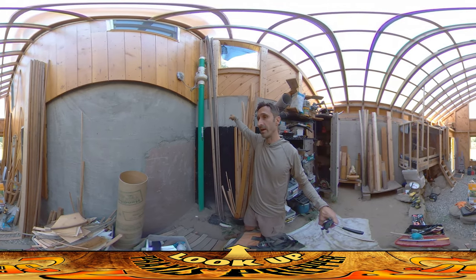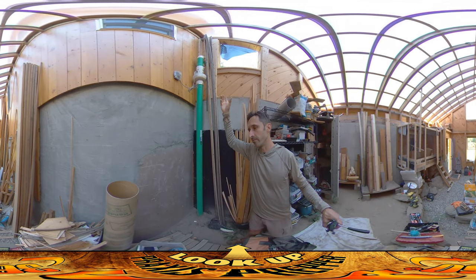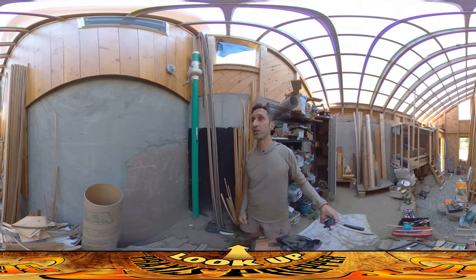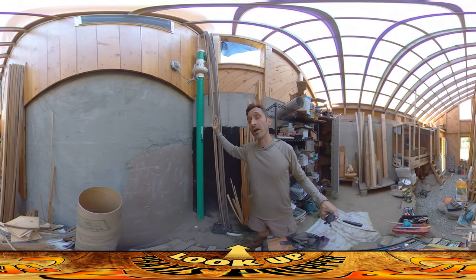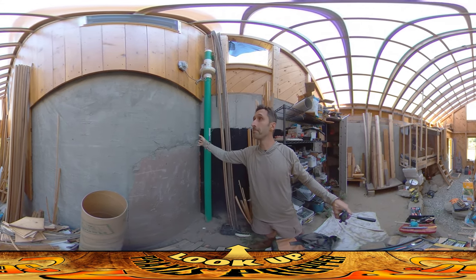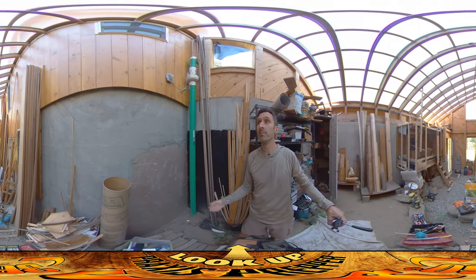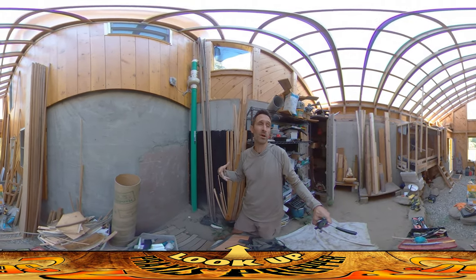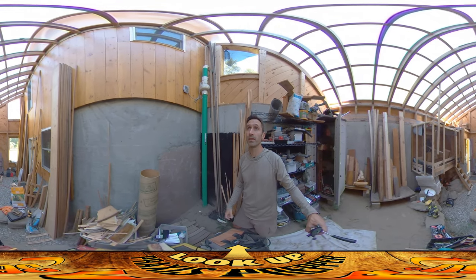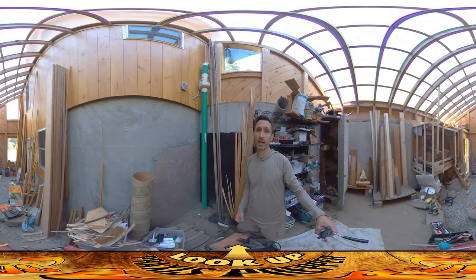If you recall, there's that air intake up over by the root cellar. One tube goes down into the root cellar, and the other tube is going to go into our air exchanger. So air comes in from the filter underground, passes into the pantry, into the air exchanger, and then there's going to be a hole here for it to get exhausted into the greenhouse. In the wintertime, it's going to be warm, humid air coming in — the chickens will benefit from it, and we'll be able to keep this room a little bit warmer as we're venting the waste heat and air from the house out into here.